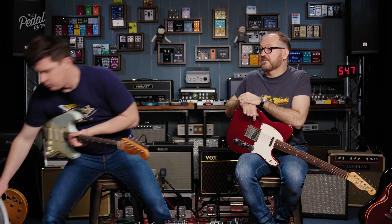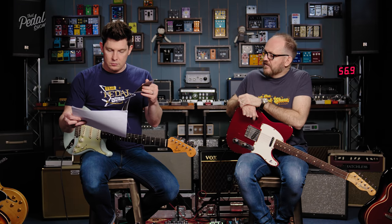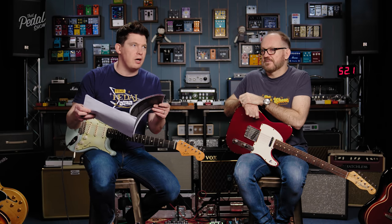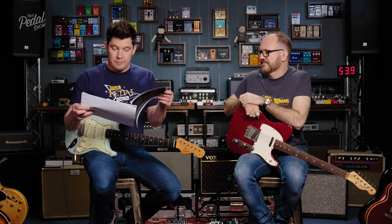For anyone who doesn't know, the Nextone is a transistor amplifier that uses four separate analog output stages to go for four different types of output valve character, correct? Yep, that's correct. The class AB power amp stages are done with solid state technology. It's not modeling. They go to great lengths to say that the way they've done the different power stages is not modeling. It's done using solid state circuitry. They are there to emulate a 6V6, 6L6, EL84, and EL34 type power valve. All the major food groups. 6V6 is most commonly known in the Deluxe Reverb, among many others.